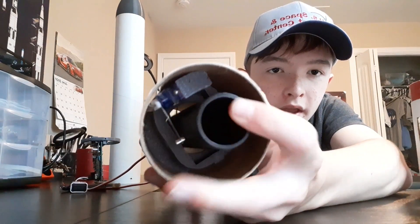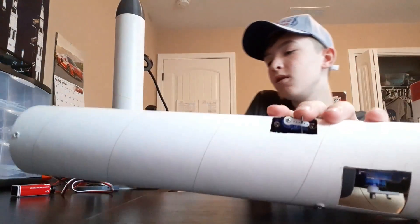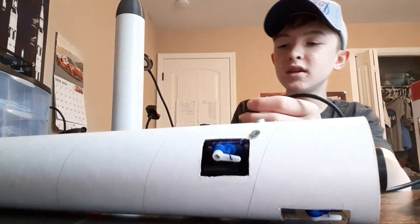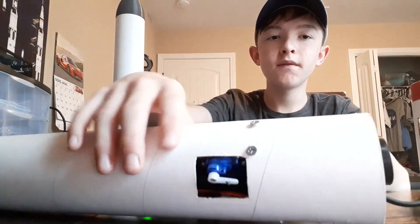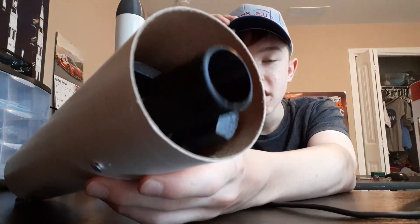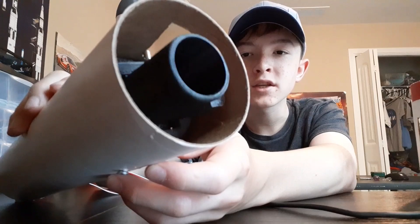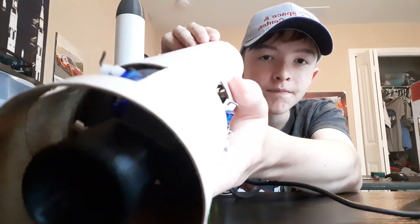You can see the motor can move around, and the two servos move accordingly. I have it hooked up to a computer because the 9-volt battery doesn't have enough power left to support the two servos. I already have code that actuates the mount five degrees in every direction. This is a test to make sure the thrust vector control mount is working and that the X and Y axes don't interfere with each other.